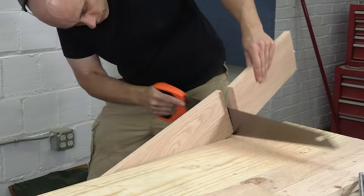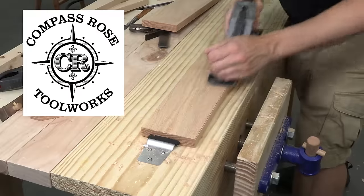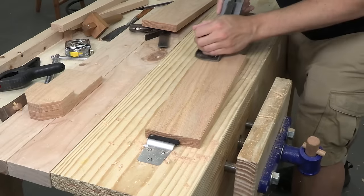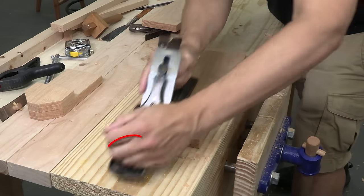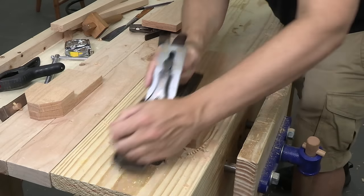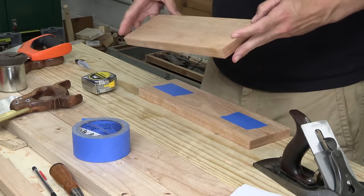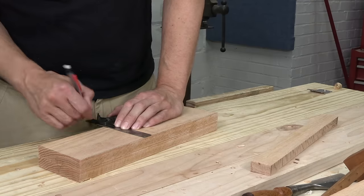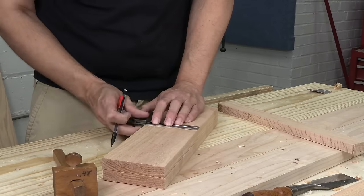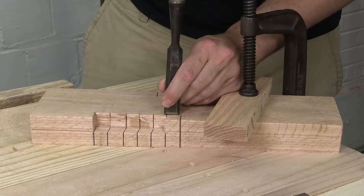All these parts are made from oak. I'm going to cut my plank into sections, then plane the inside faces for a smooth glue joint. I'm using my Compass Rose Ready-Set Planing Stop with the nylon cover — this keeps my stock free on the benchtop but the cover keeps the teeth from marking my work. Once these pieces are prepped, I stick them together with blue tape and CA glue and do all of my layout with a square and a pencil. Doing it this way keeps both pieces identical, and I'll keep the pieces stuck together while I saw and chisel out my shape.